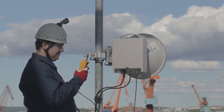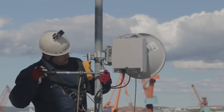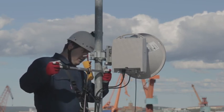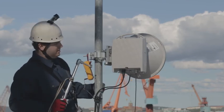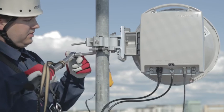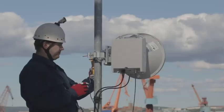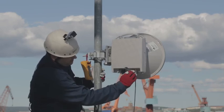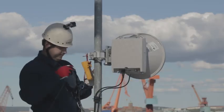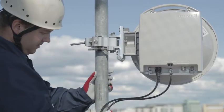Now you should have reached the expected receive signal strength given in your site installation document. Tighten all the screws using a torque wrench, making sure the antenna doesn't move while tightening. Have the voltmeter connected and check that the reading does not change. It is a good idea to tighten the screws at one end at a time — this way you know which antenna has moved if the voltmeter reading changes. Also tighten the azimuth adjuster nuts. When finished, disconnect the voltmeter, put the weather protective cap in place, collect your tools, and make a final inspection of the installation. You are done with the antenna alignment.